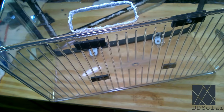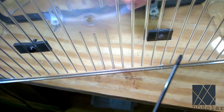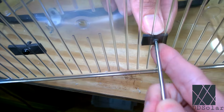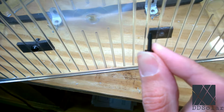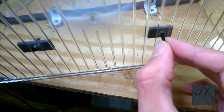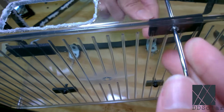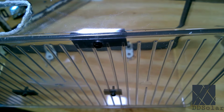Now I'm going to install the nylon bolts behind the foam pieces. So I'm going to make a hole in the foam using a very small screwdriver, and it's smaller than the actual nylon screw itself, which is right here, so it will seal around it pretty good. Plus, when I tighten it down, it will seal even better. Okay, there's the 3rd mounting location.